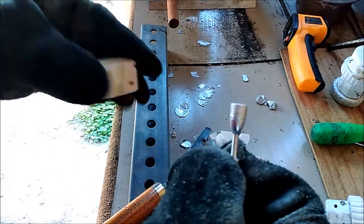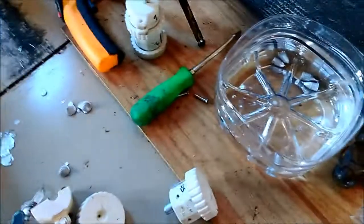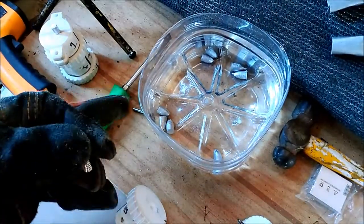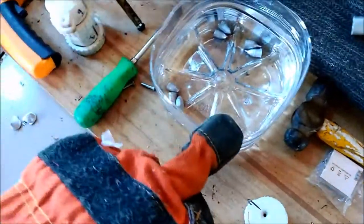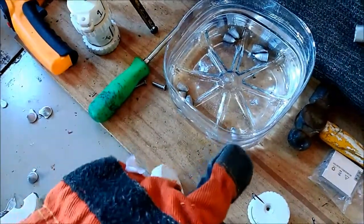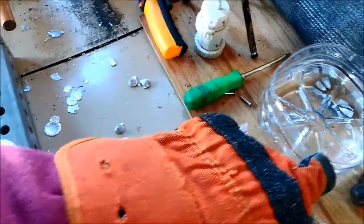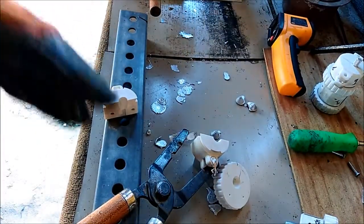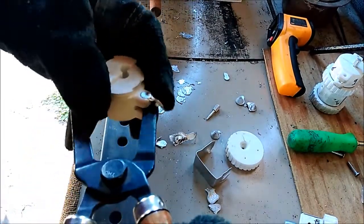That's actually a damn good bullet. I'll see what it looks like when I put the calipers on it. My water bucket is right there — I'm putting the first oblong bullets here, and this third one from the good nine millimeter bullet mold is right here. I'm going to quit talking and just keep casting, because every time I stop to say something it gives my mold a chance to cool down.